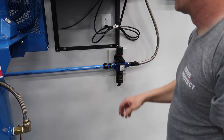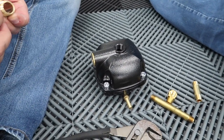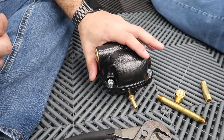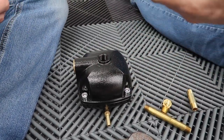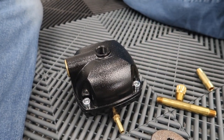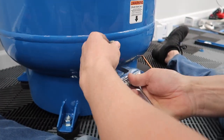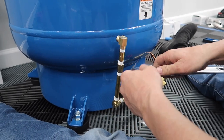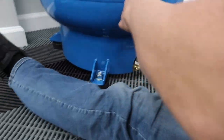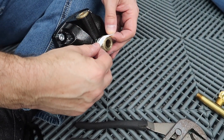We'll keep creeping down. Here's our PMA 201. Now, this is a magnetic float type drain. Is it magnetic or am I making that up? It's a float valve, but I think it's got a magnetic seat in it. So when it drops, it seals off with a magnet. But once it gets enough water, it breaks the magnet loose and floats up. So what we're doing is setting up an intricate web of fittings in order to hold this little tank off to the side, off the front of the tank. This doesn't have to be powered, so it's different than a typical solenoid type.